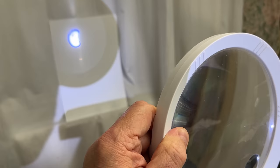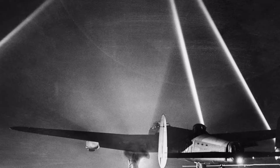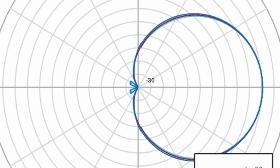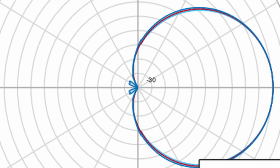A 13-wavelength diameter optical lens would only be 6 micrometres across — a tenth of the diameter of an average human hair — so our radio lenses aren't going to be high quality by any means. If we make a lens from a suitable material we should be able to gather radio waves hitting the face of the lens and concentrate them down to a radio receiver, or if we have a radio transmitter at the focus we should be able to form that into a fairly narrow beam, making the signal received at a distant site stronger — just like a flashlight or a searchlight. We aren't adding any extra power; we're just sending more of the energy in the direction we want. You might have heard this property of an antenna being called gain — I prefer 'directivity.' The whole point of these printed microwave lenses is to make an antenna with good directivity.